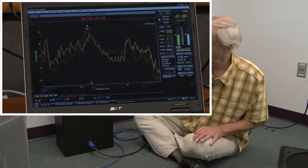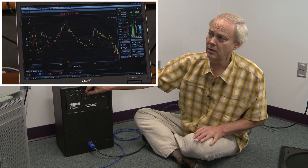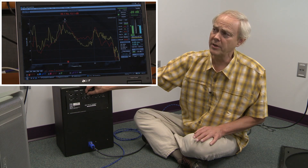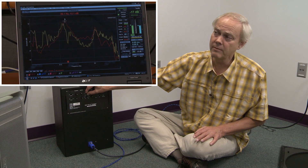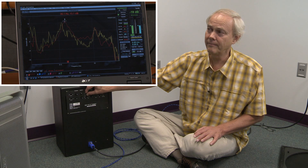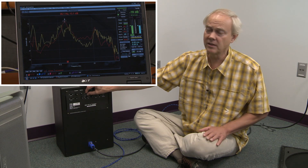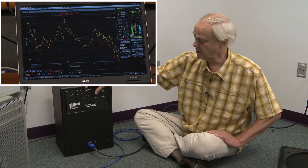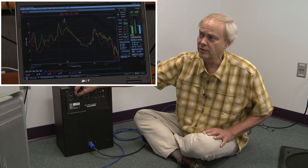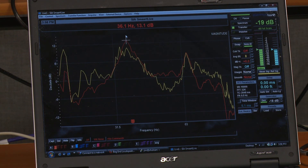As I turn it down in frequency, you can see the graph show the effect is now below the tuning point. As I come back to the correct frequency, we're knocking three or four dB off the magnitude — maybe a little more. Importantly, we're affecting the time domain: the sound is ringing and booming in time, and it's also reduced in magnitude, which in this particular room would certainly be accentuated in that region when listening to a recording. This would be a successful tuning for this room. You can also take the feedback control and turn it down to have a little less effect, and this is where taste comes in.